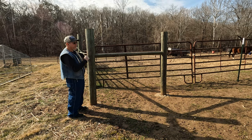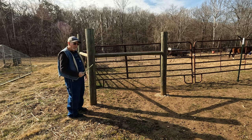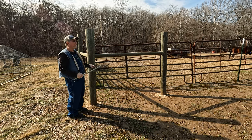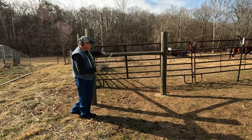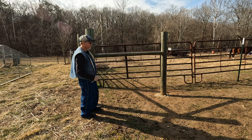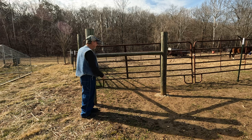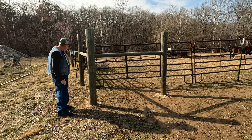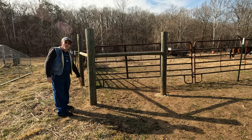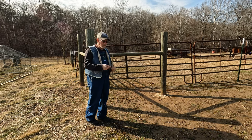And I have one down there that's set up like what they call a dead man. It looks like an H. They typically put it in between, like on a long fence row. We have one down there on a 300-foot stretch. On those you put an X because you're pulling both sides. So you have one down there and one down here. Then this one on this side is always from the brace post down to the ground of the corner post. Always the same way. So that's what I'm going to be doing here.